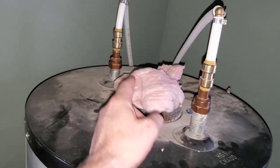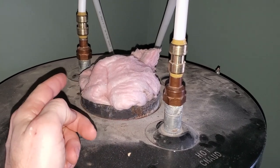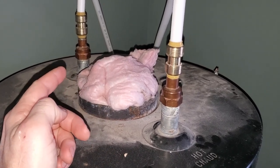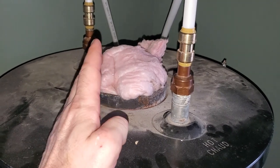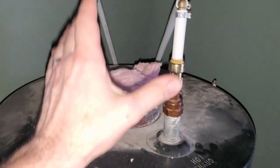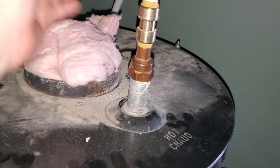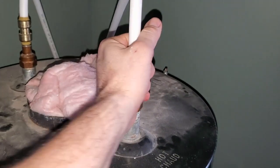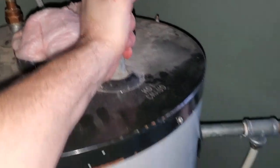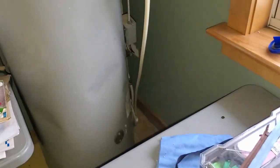On the domestic side of the hot water, yes, there's a pump — it's just our well pump, same as in your house whether you're on town water or you have your own well. That pump keeps your lines pressurized. But that is separate from this heating loop. This loop circulates all on its own; the domestic side is fed and pushed out by your well pump, going to your taps to do dishes or take a shower.